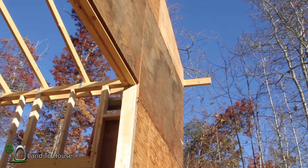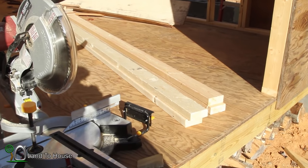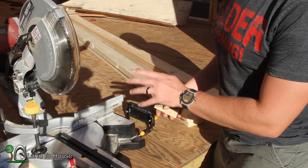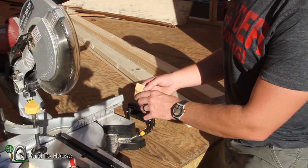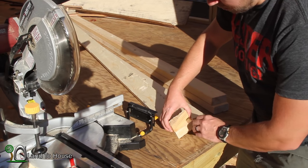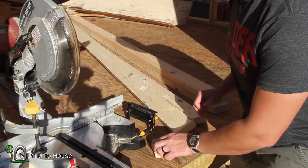I finished installing all the boards up here — for some reason I'm thinking that's called a sub fascia. Now it's time to move on to the ladders, which I've never built before. I've got some 2x4s set out, and sadly I forgot to save one of the angles from the trusses. So the extra truss I built that I didn't need, I cut off the end and I'll use the rest of that board as blocking. I'm going to take these 2x4s and cut this angle back out so that it will match the trusses — cut that on this end, flip it around and cut on the other side, so I'll have the same board basically as the trusses.